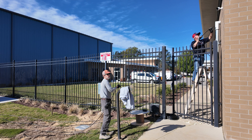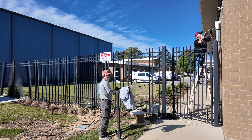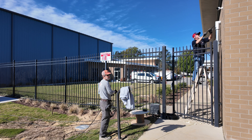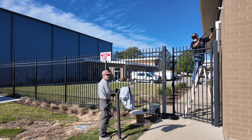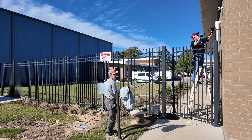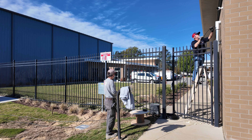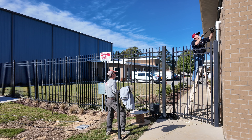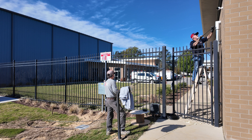Jordan's at the MDF side pulling the fiber we've got looped out here at the conduit side — pulling it up to him. We should have about 30 feet of slack once he gets it, and then we've got another 20 feet on the vault side that we'll pull toward the new building MDF and leave it in there. That'll give us enough to splice on LC single-mode connectors on Monday of next week. Today's Friday — we'll come back Monday to splice, label, certify, and wrap this project up.